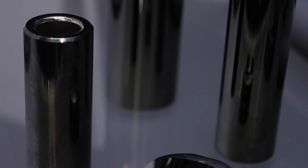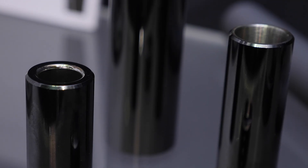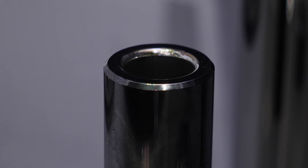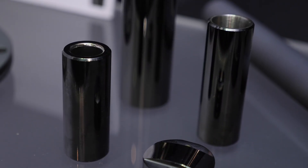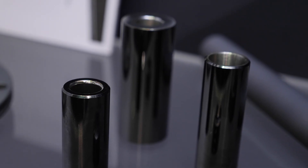So focusing on that wrist pin again — where would you see the advantages of a DLC coated wrist pin compared to the non-coated component? Are we talking about frictional reduction, life expectancy, or is it a combination? Well it's a combination. You DLC coat a pin with a good DLC coating and a good pin material. There are a lot of different pin materials, and pin materials are relevant to the type of engine it's going in.